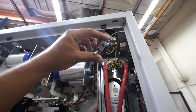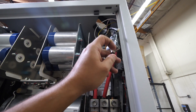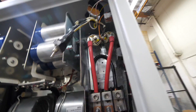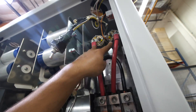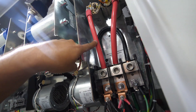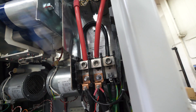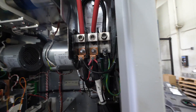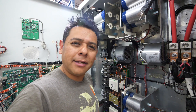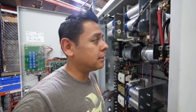This should be black — I guess they didn't have black. Anyway, it seems like someone did this so you come in here, disconnect it, it turns those off, and the battery power is disconnected. But the negative side of the battery pack — up to 600 volts — just loops over and goes to ground. This box is grounded to battery negative. That's weird; I thought you'd have these systems isolated.